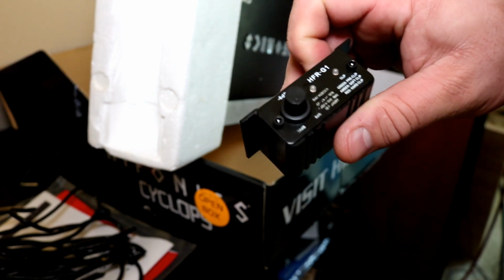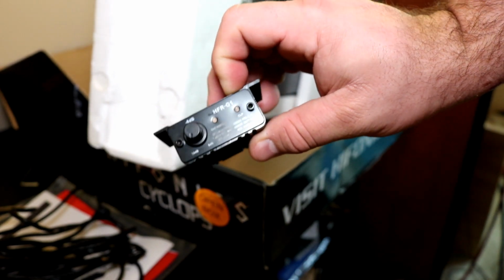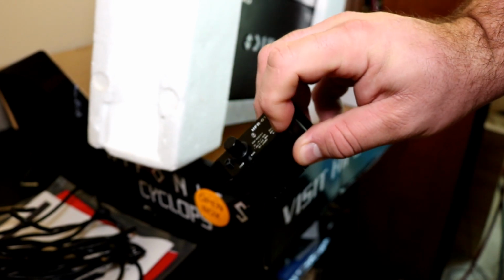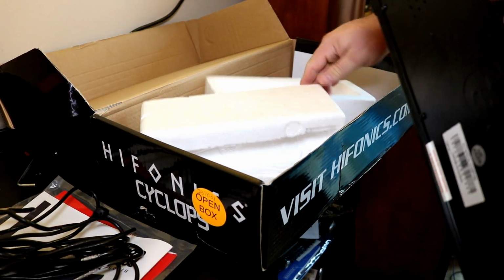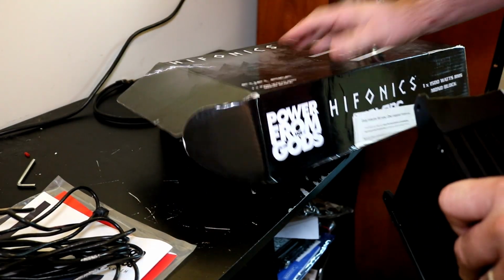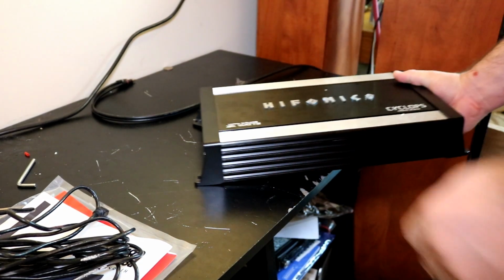So if you're in the green, no distortion at all. If it goes amber, that means you're in the distortion part of the amplifier. You haven't fully clipped yet. And when it goes red, you're now clipping. So that's nice. For $150, I wasn't expecting that. Now granted, this was probably a $250 to $300 amplifier when it was new. So even at that, you don't typically find clip indicators on amplifiers sub $300. That's usually reserved more for the higher end.